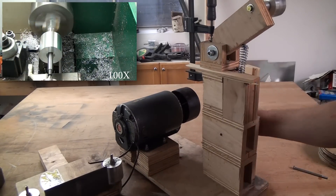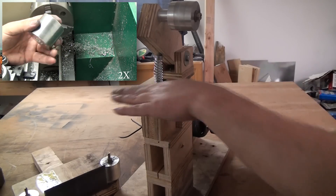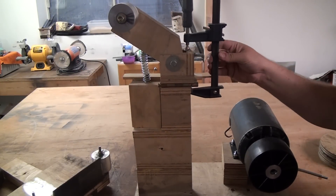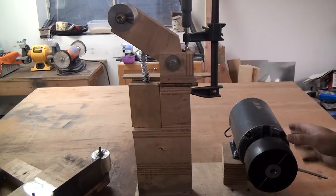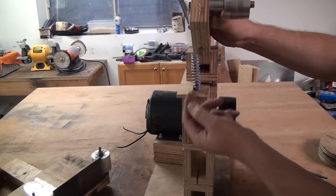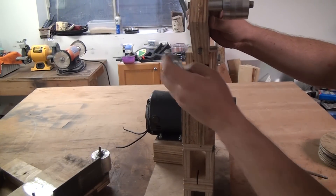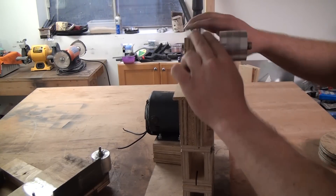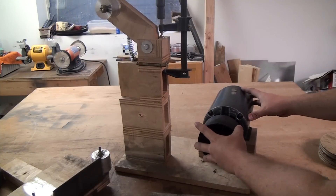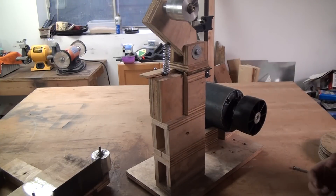The tracking mechanism isn't great. I thought for tracking you needed to tilt one way, but in reality I believe you need to tilt the other way. This is built to tilt on a door hinge I had, and it's just being held together with a Harbor Freight quick clamp — it totally works but it's rough. Belt tension is a problem too; there's a bolt through here with springs from Home Depot — a two-pack — just mushed together, two springs intertwined. Tracking is a bit of an issue. I leave it loose, clock it to help tracking, then lock it down, and so far that's worked.